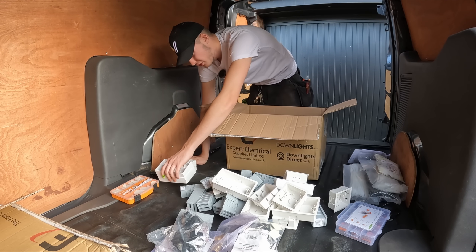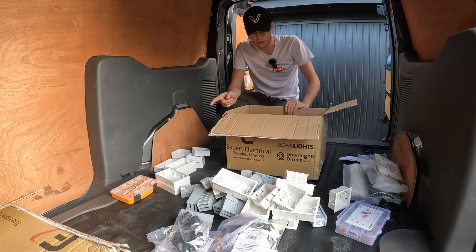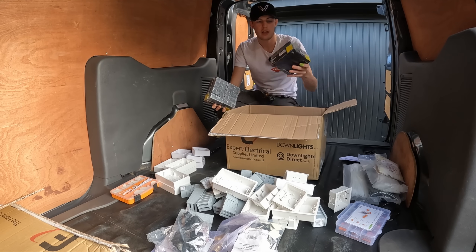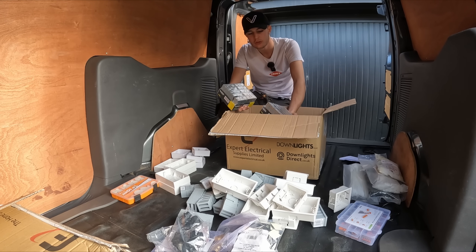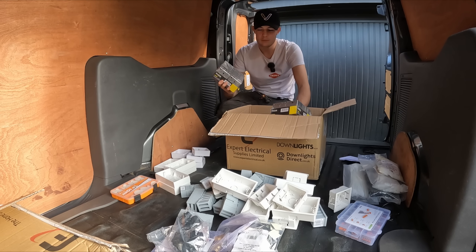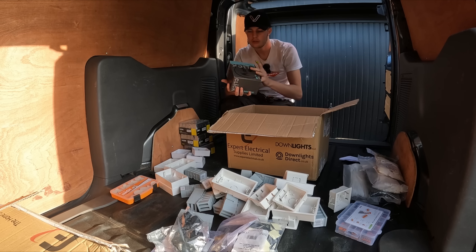There are even more patresses - we've got the malleable ones, which are really good for kitchen cupboards or for that extra little socket in your garage. We've got singles and doubles of those. Now we're on to galv boxes - galv singles and galv doubles, only stocking 25mm depth. I'll order 35mm if required for big back boxes or shower ones because they're just too bulky to keep on the van in my opinion, though Nick keeps a couple.